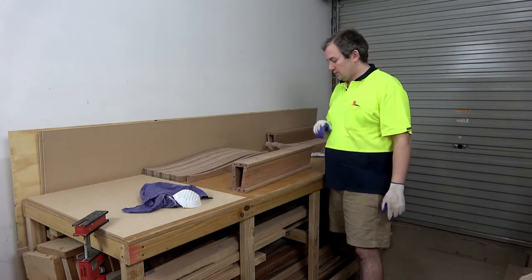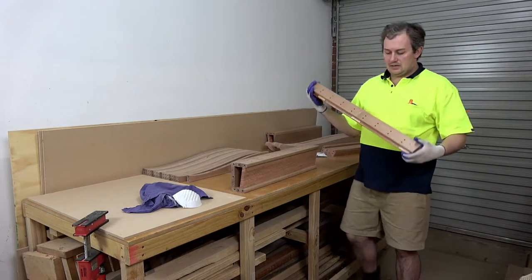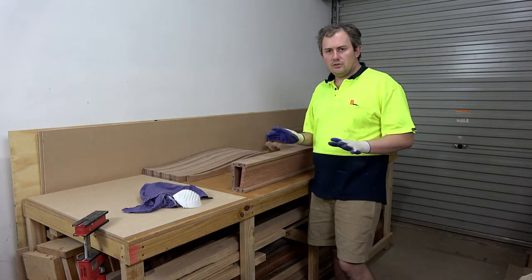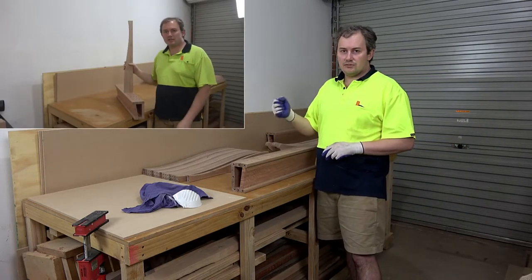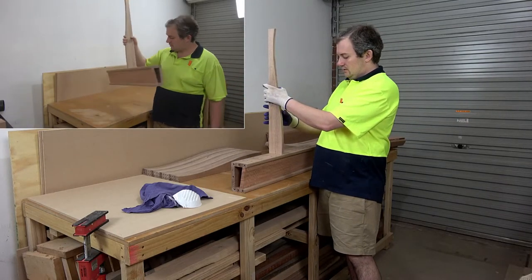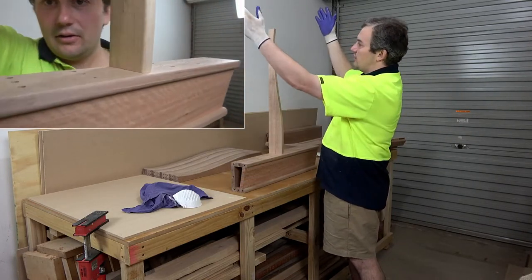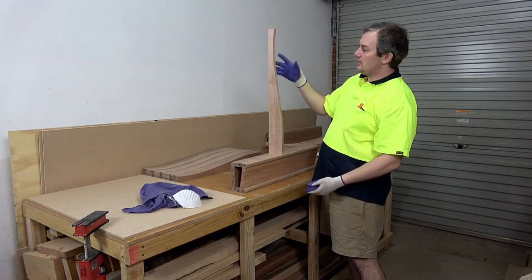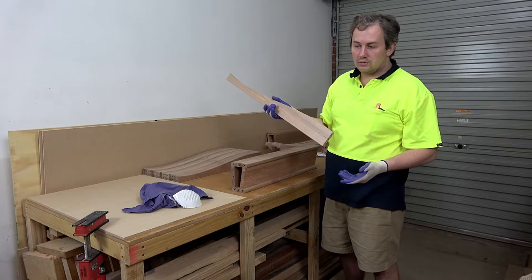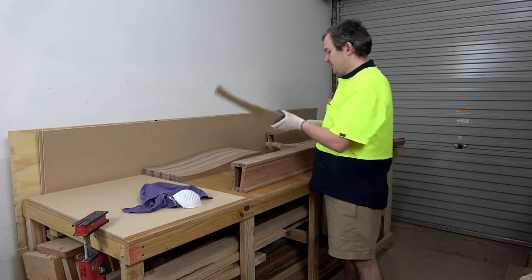So what I'll do, I'm going to put the dowels into this surface and into this surface first with a little bit of glue. I don't need a lot of glue, as you saw that the joint itself holds itself together, and because these slats are going to sit there, top rail over the top, and the legs that come on the side of that holding this and the top rail at a set distance apart, these are actually captured. So if I wanted to make the argument that I don't need glue at all, I could make that argument. I'd be wrong, but I'm not that far wrong.